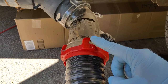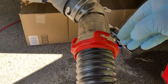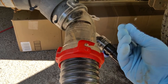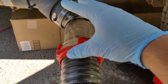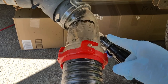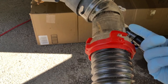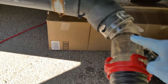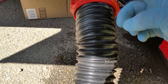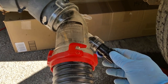One improvement that could have been done here is if this was up on top, so when stuff starts coming down — because the snake was going up here — what I did was take another rubber glove and jam it in there around the snake. When the release started to happen, I only got a few drops of mess. It really wasn't too bad. Better yet would have been to rotate this whole body 90 degrees so this would have been up on top, but that made this portion down here have quite the U in it, and I thought it's going to flow better if I just keep it the way it is. Anyway, that's what I chose to do, and it worked for me.